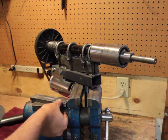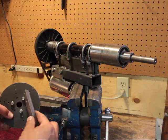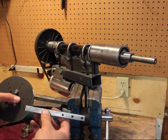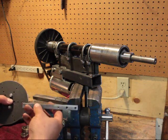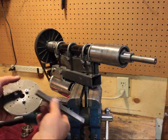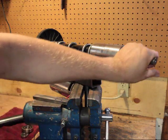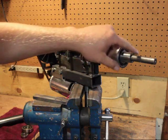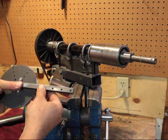What's different about this one from others I've made is I've made these struts. This is going to be a three-blade machine. I've gone ahead and put six positions there, just in case I decide to change that later, but it will have three of these. They'll be drilled and put on center, I'll inspect them, and then I'm going to weld them right in place. That gets me a little further away from the hub. With this 5.3 to 1 ratio — if you've seen my first video — I need a little more torque to get things going because there's some resistance there. So I wanted to get further away from the hub. That's my theory at least.